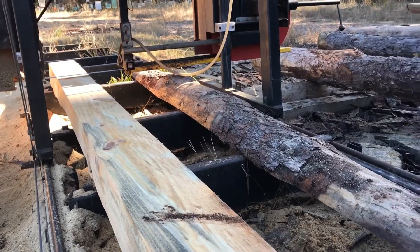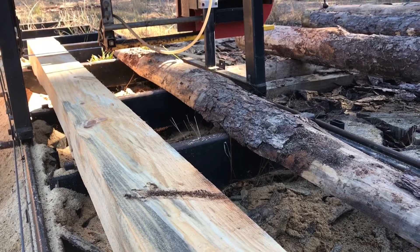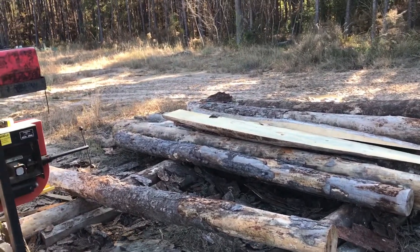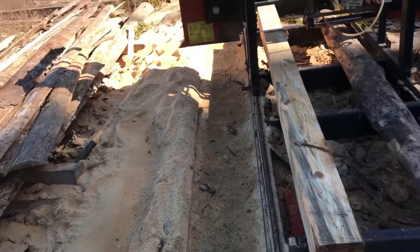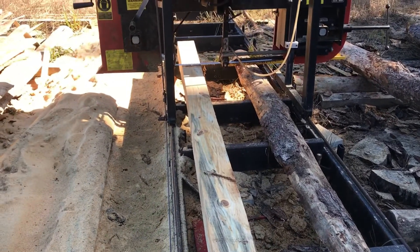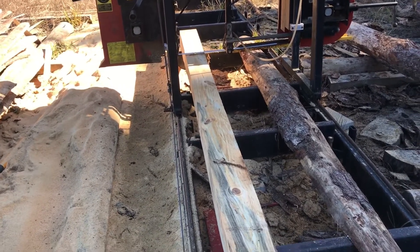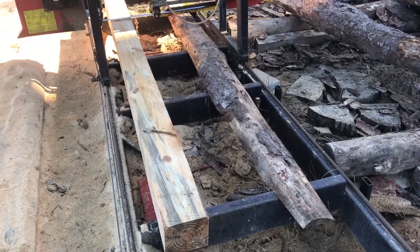So it's kind of a mix — I'm not desperate to get value out of every little scrap, and it takes a while to process it. A lot of times I do throw it away, but I kept these ones because there just seemed like there was too much material in them to discard. I'm going to try to do something with them and see if I can get some value out of them. The main thing I wanted to mention again is this idea of planning for that final board to be scrap — not getting surprised when you're done with a board that's an odd thickness but perfectly square. You can plan it so when you roll the log face down, you've got just enough flat spots to square it on the deck, but you've got a bunch of wane and waste in it so it truly is a scrap board when you're done.